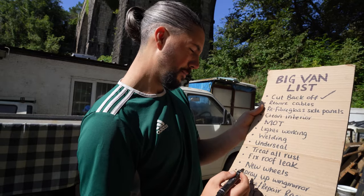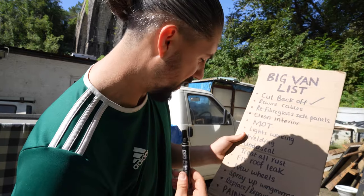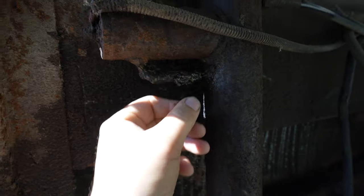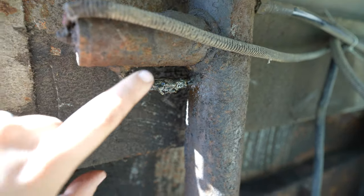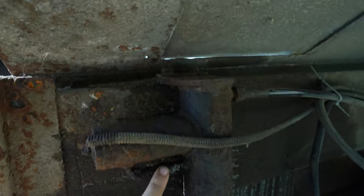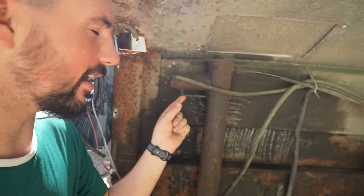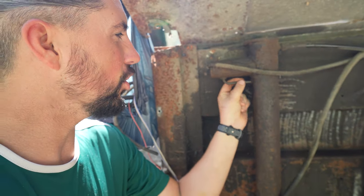This right here is the part that leaks on the ram. I'm going to try and get some of this stuff off - obviously a lot of high pressure comes through this. If I can't fix this one, I'm going to have to fit a new one, which shouldn't be too bad - two bolts up there, two bolts underneath. The hardest part will actually be removing it from the plate that lifts the floor up and down because I don't know how rounded that bolt's going to be. I've peeled off all that old gunky stuff and now I'm going to give it a good rub down, clean it all off, find out where this little pinprick hole is, and find a way of sealing it back up - maybe some kind of welding filler or something like that.